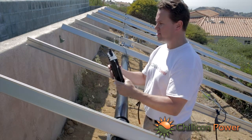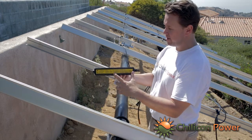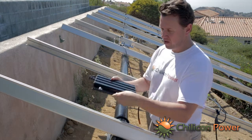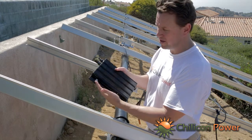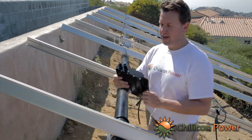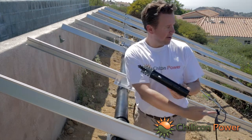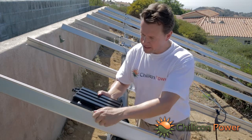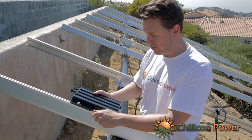Now for both of these locations, notice that the inverter is getting mounted upright, and upright is indicated by the label. It's also indicated by the grounding bracket here, which in this particular installation we won't be using. We'll be using WEEB to do grounding. So we're going to go on this side because it has the advantage of having the LED be uphill, so that later if the installer wants to look down the entire length, there will be 4 panels going here, so there'll be 4 inverters installed. It's possible to look at these LEDs and see them providing their status information that everything's nominal.